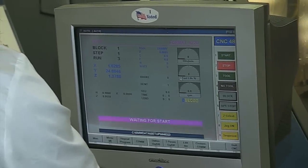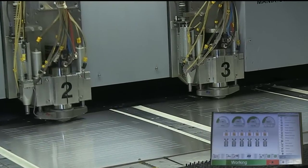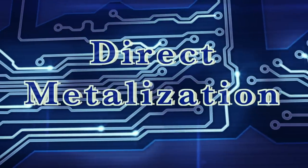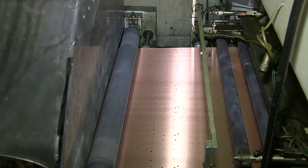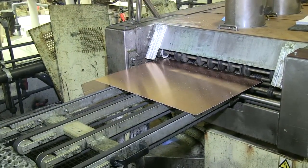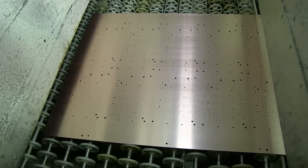Drill change is fully automatic. The machine selects the drill to use from the drill rack, checks that it is the correct size, and then loads it into the drill head. Once all the holes are drilled, the operator unloads the panels from the drilling machine and discards the entry and exit material. Byproducts of the drilling process are burrs in the copper surface as well as dust and debris within the hole. We address this via a deburr and hole cleaning process. Our deburr machine takes 40 thickness measurements of each panel and optimizes the upper and lower brush height to maintain an optimal brush-to-panel footprint. To help initiate the copper plating process, we will first metalize the hole surface using a direct metalization process called Shadow. Next, we use water jets in excess of 1,000 psi to clear the holes of dust and debris.